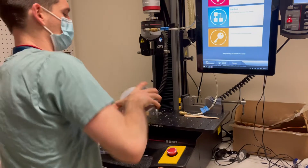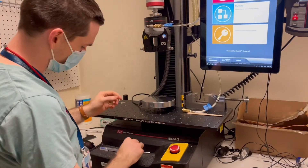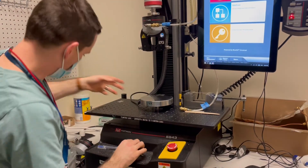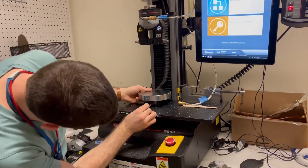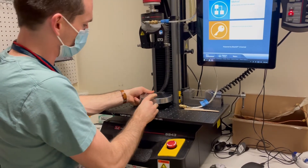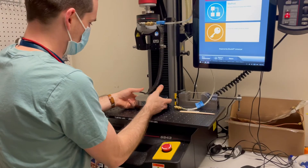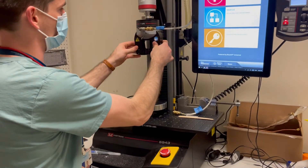To put on the compression platen on the bottom — normally you would have both grips the same, I'm just demoing both — you can use one of the larger pins; it's a little easier to reach to put it through the bottom. There's a little nut on there and you can tighten it against the bottom, so that will fix them in place.